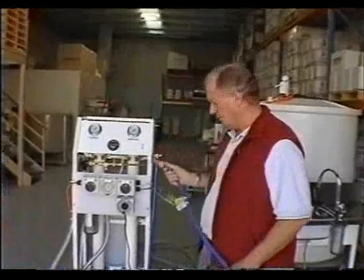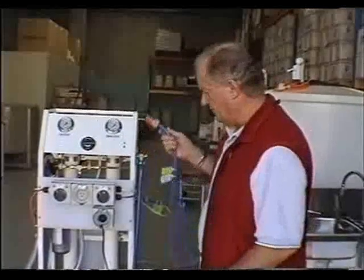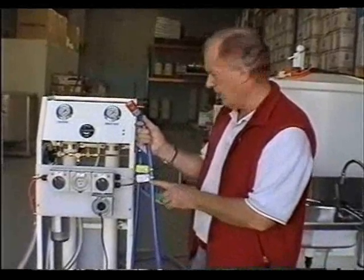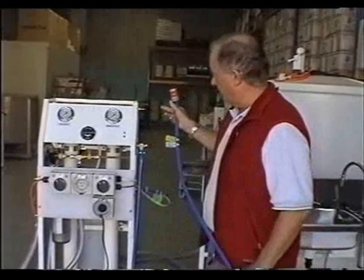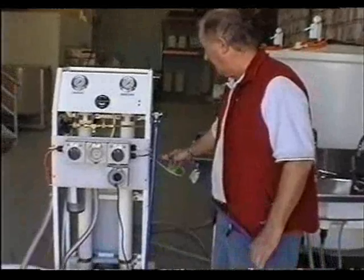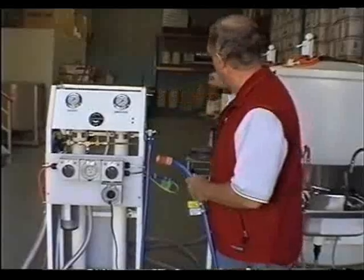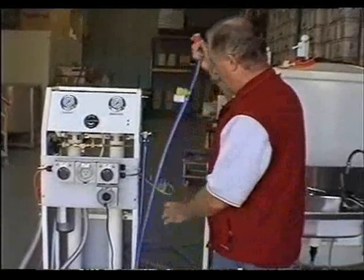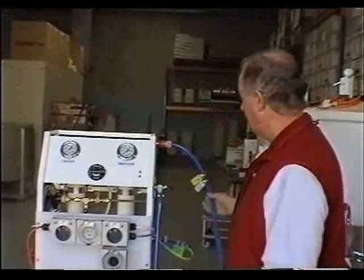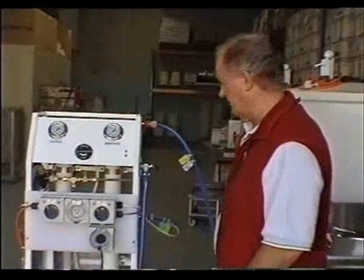As I said earlier, all waste lines and reject water lines are in blue. There is an additional line provided which is marked with colour-coded tags, yellow and white. You will remember we disconnected the incoming water supply and applied the plug. We also have to disconnect the main clear line to the tanks and put on this drain hose, the blue drain hose, into that outlet which would normally run to the product water tanks.